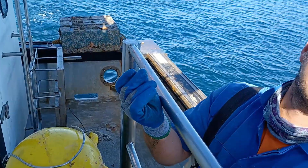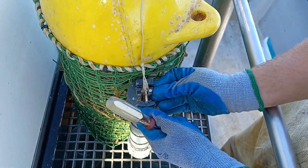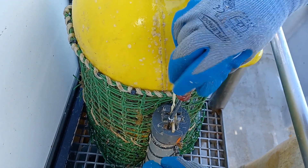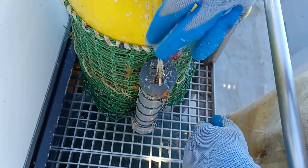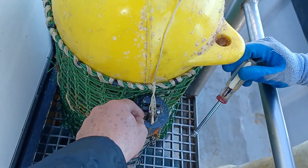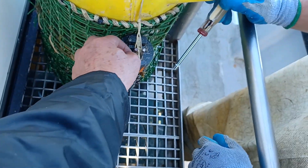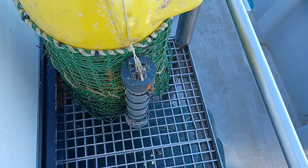This is the long line, yeah? That's good — straight through. If you just tighten it, it'll be fine. See how this one, if it were to bend over, it could touch here again — it wouldn't work properly anymore, it's a short circuit. So I'd cut it off here, maybe snip this one a little bit short as well, just enough to have a good handle to remove it. You can leave it a bit longer to make it convenient to remove later.